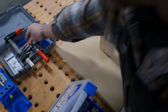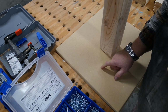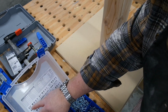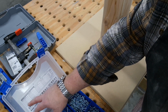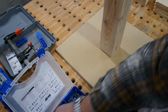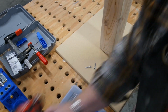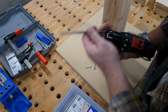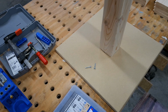And we need a bit. And since MDF is super dense, I'll just treat it as a hardwood. It should say, maybe it does say in here, but you don't have to. But if we're going to, 3/4 inch, 19 millimeters, or into that material thickness, so we just use inch and 1/4 screws. So let's get a couple of them out, and let's do that. I'll go get my impact wrench or impact driver.